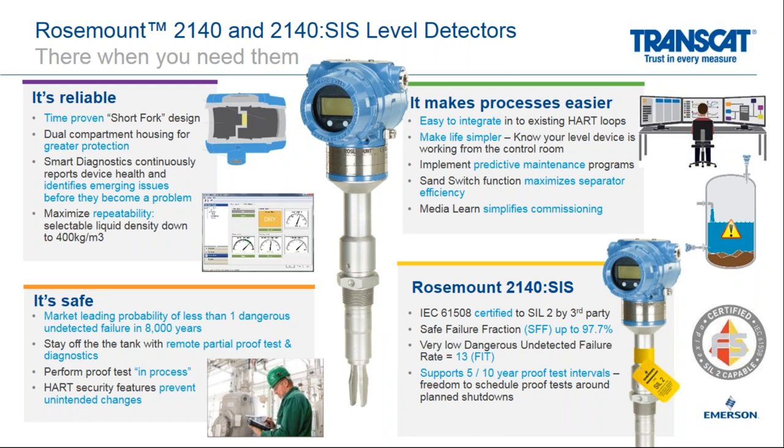I don't have HART communication. Is there still a benefit to using the HART 2140? Yes, that's another excellent question. I get this question a lot because this device is digital. It is operating in the HART realm, but it also has the analog portion. And if you understand how HART works, it's overlaid on top of the analog signal. So that means that you always have your 4 to 20 milliamps, and the HART digital signal is just seamlessly being communicated on top of those two wires.